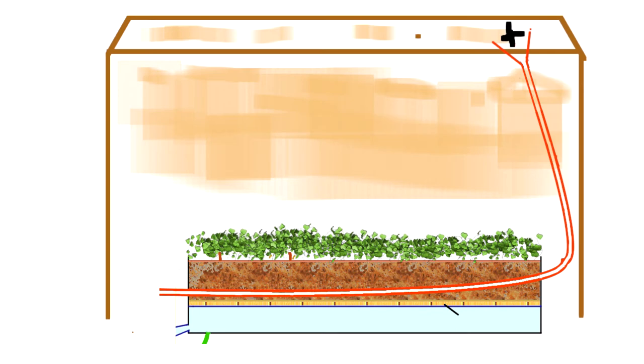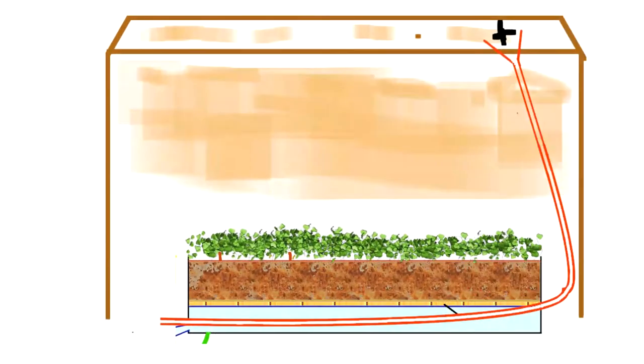The next concept is very similar — doing the same thing into the water below the soil. We're collecting heat from the air in the afternoon when it gets possibly too hot for the plants, and pumping that heat down into the water. The air comes out drier and cooler at the far end, saving that heat so that at night the greenhouse won't have a very big temperature swing. This should be better for the plants to grow evenly through the day and night. Water will also be collected at the end of the pipe.